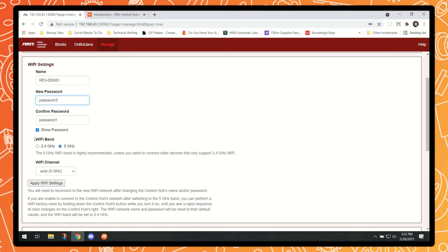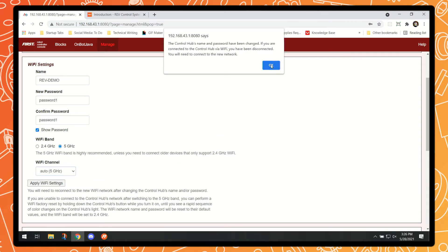The next thing you'll see is the option to choose a Wi-Fi band. We highly recommend choosing the 5 gigahertz Wi-Fi band channel if you have a device that supports 5 gigahertz. We know we're likely using a driver hub with our control hub and it is a 5 gigahertz capable device, so we're going to click this button and also select auto-assign to a 5 gigahertz channel. The control hub will find the best channel within the Wi-Fi bands. At an event, a staff member may specify which channel to operate on, but for most schools or home use, doing an auto search is going to be the best option. We're going to apply these Wi-Fi settings and hit OK.